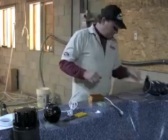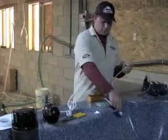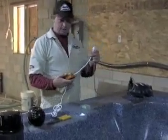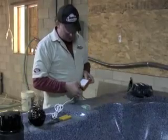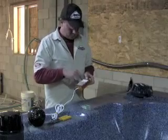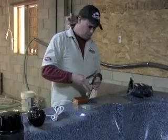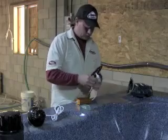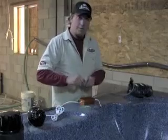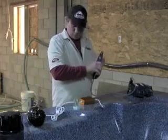Now, the lead that was coming off of your generator that was going to the previous cell is going to go to the input side of your current limiter. And it'll say on here too, 1 amp load, an arrow going out, going to the cell, source, 12 volt. But we obviously don't have a plug like this, so you're simply going to cut the plug off. Then we'll get some couplers, like spade connectors, male and female connectors, and couple these on.